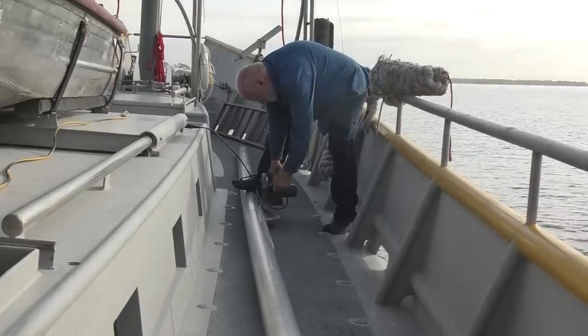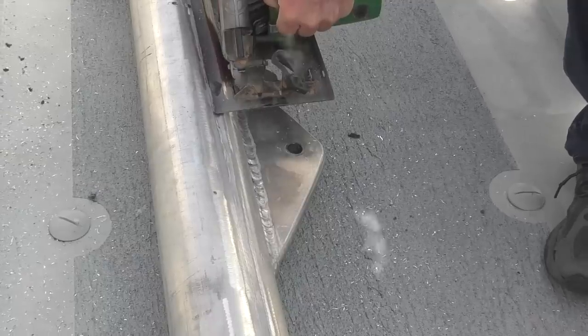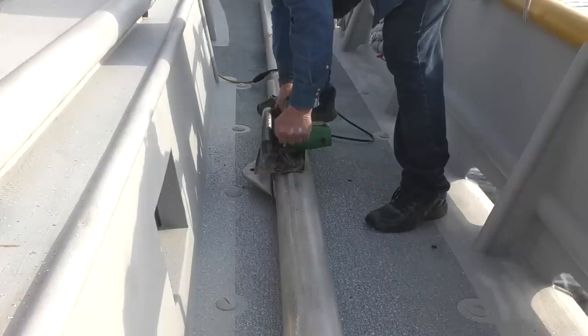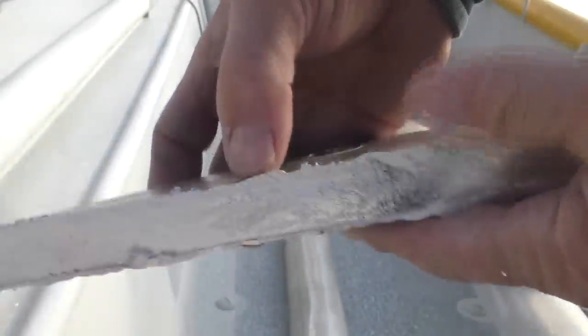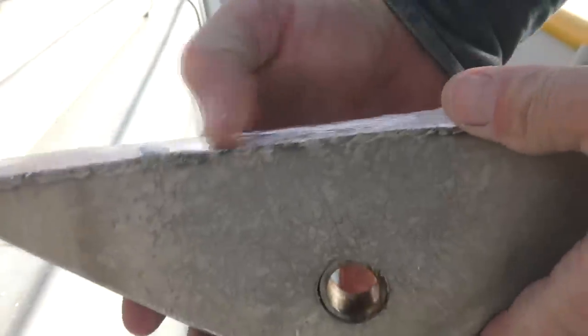I'm going to cut it in half lengthwise. A lot of people don't know it but you can cut aluminum with any old carbide tooth blade. You're going to be hard on the blade - I've got a couple teeth missing there, that's why it's jerking back on me. It's got enough life in it to finish this cut, that's why I buy the cheap blades. It's a pretty serious cut and when you lose a few teeth it gets a lot harder, so better just change the blade out.